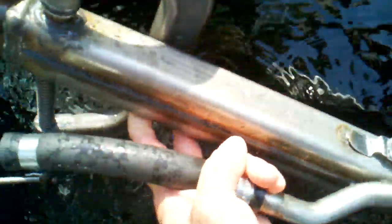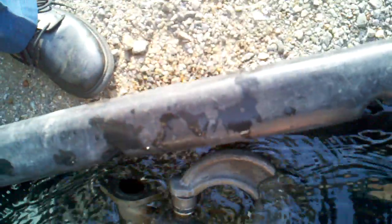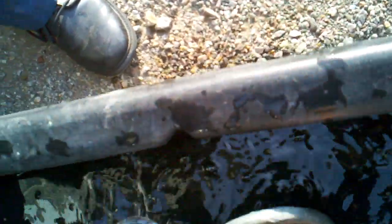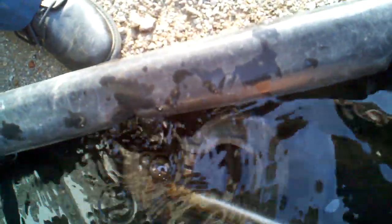That's the bubbles that you're seeing there. When we air this up on a new system or one that's working properly, there should be no bubbles coming out. The other side that is sealed is right there at that C-clamp — that's got that sealed off. And you can see the bubbles coming out as I try to fill this up with water.